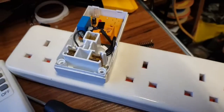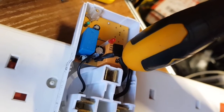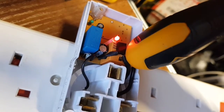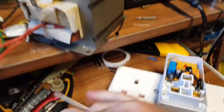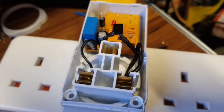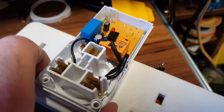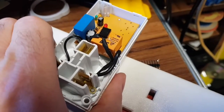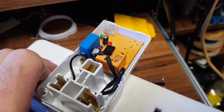A bit of progress has been made. Now I need to poke this down with the screwdriver because the little switches at the back aren't making contact. If I turn it on and off it does work, but you can hear the relay chattering — so there's not enough power to keep the relay contacts closed. There's another fault here. I suspect what probably happened is the relay started chattering, generated a high voltage spike, and blew that zener up. We need to look at why the relay is chattering — maybe these electrolytic caps are also dry. Could be worth recapping the lot.